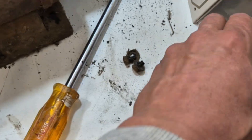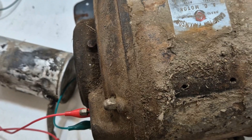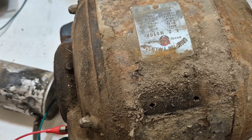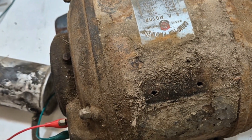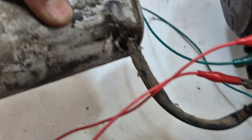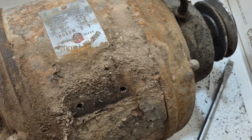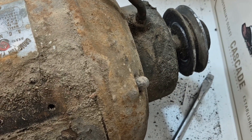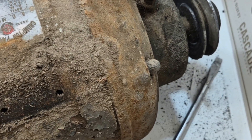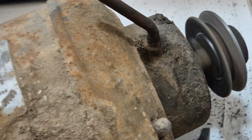That capacitor was originally clamped on there, but we might get him a new one anyway because it's measuring about double on the ESR meter what it should. There's a great big dent in the end of it - dents all over it basically. Now it's actually not running at all and I think I've seen that before - yeah, give it a whack.